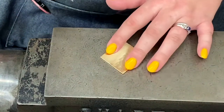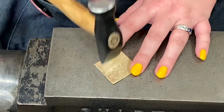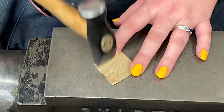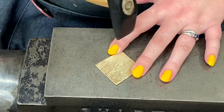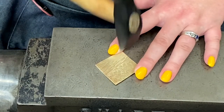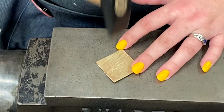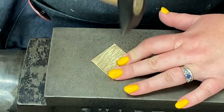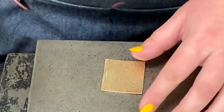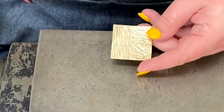For the other side I want to show you the cross peen look. You can see it's not exactly laying flat anymore either because it's work hardening where I'm hitting it. Working to overlap the strokes and keep my fingers out of the way. You can see now it's definitely not flat anymore, but look how beautiful that is. And then you could obviously overlap the two textures together if you wanted to.